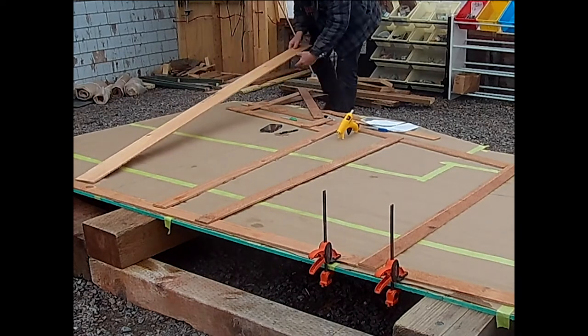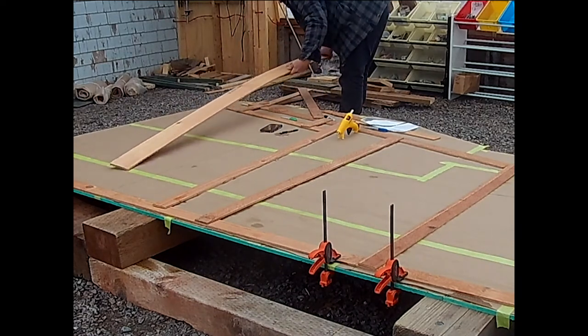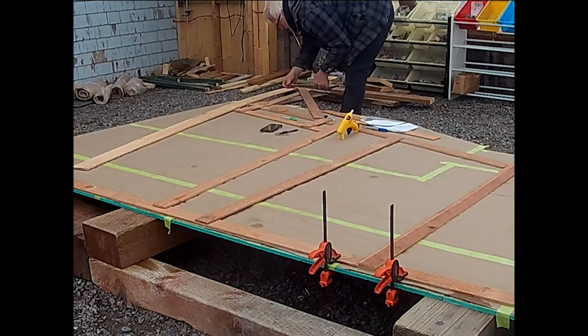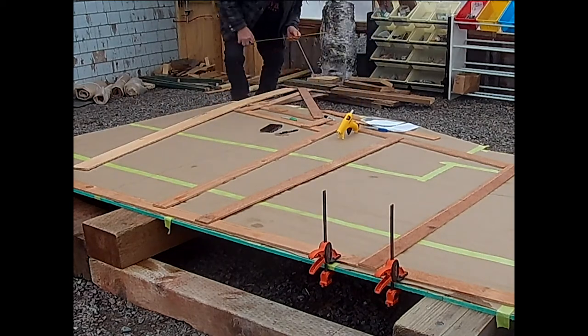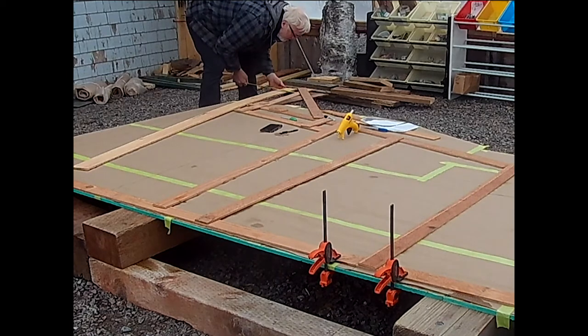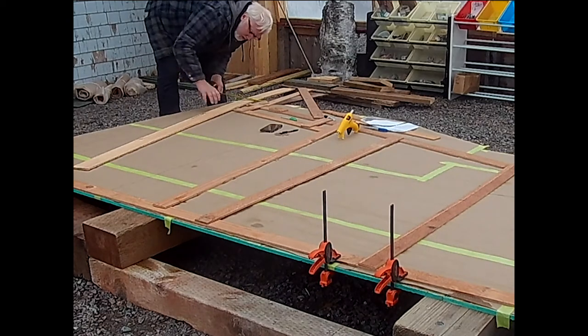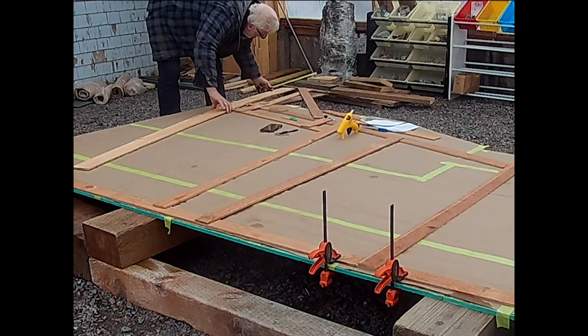With the pattern of the transom knee in place, its afterside indicates the angle the transom will lie on. Using a batten, I am transferring that angle down to where it intercepts the base of the keel to help determine the length of the skeg. Gudgeons on the skeg will hold the pintles from the rudder.